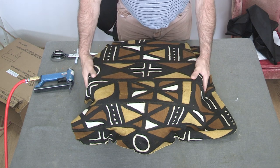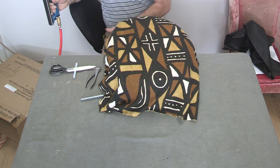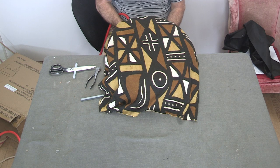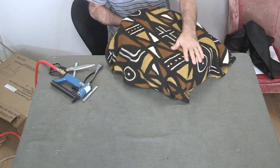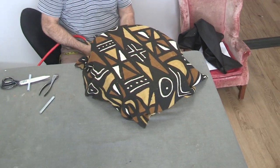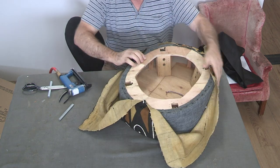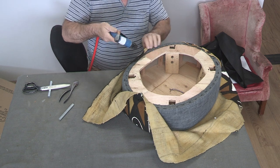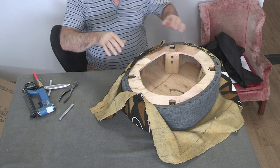So what I'm going to do first is do the sides here. I'm going to hold it down like so and do a pin staple. If you've seen some other videos — this is probably for advanced people used to their gun. I'm not putting this staple in all the way; I'm actually putting it on a little to the side. That's not a permanent staple. Then I'm going to bring it over to the other side, give it a little pull, and semi-staple — meaning I take the head of the gun and just tilt it. I'm not ready for a permanent staple yet.